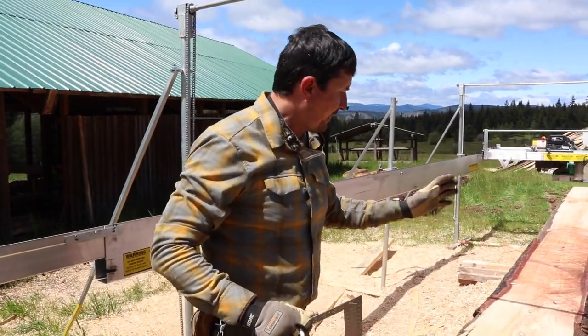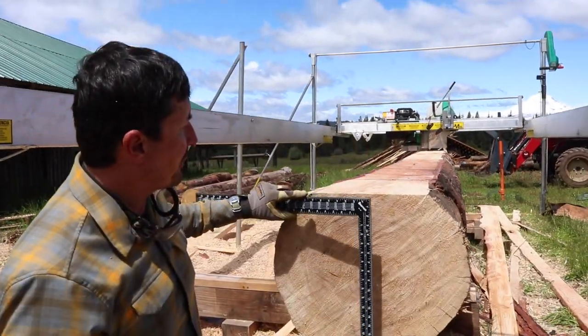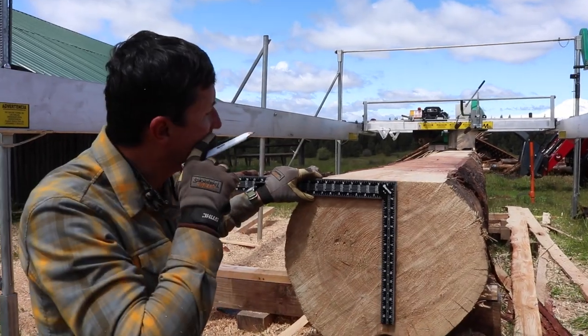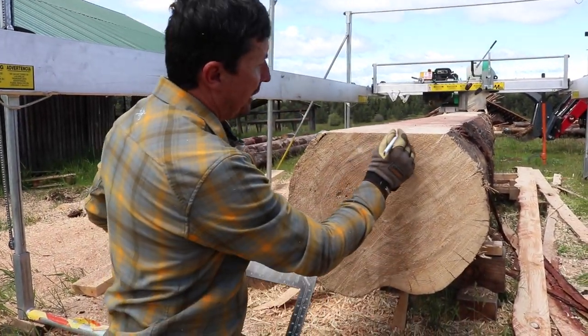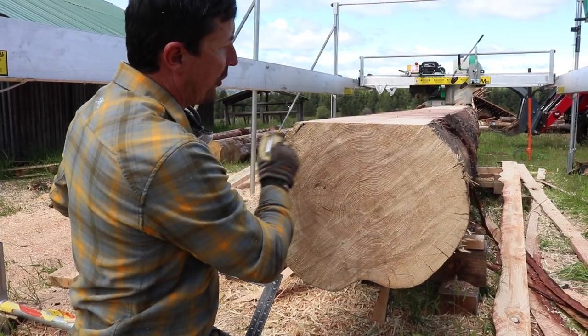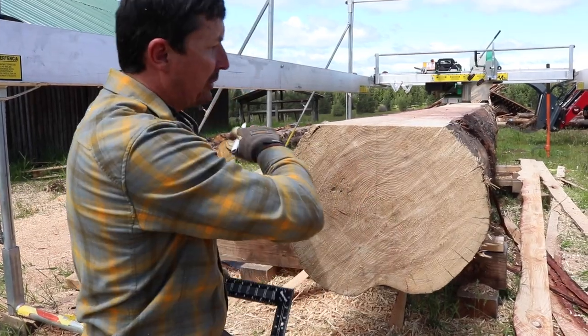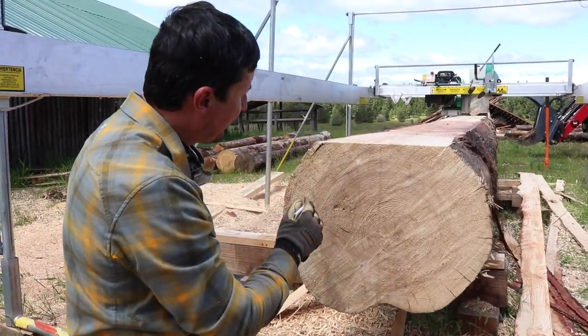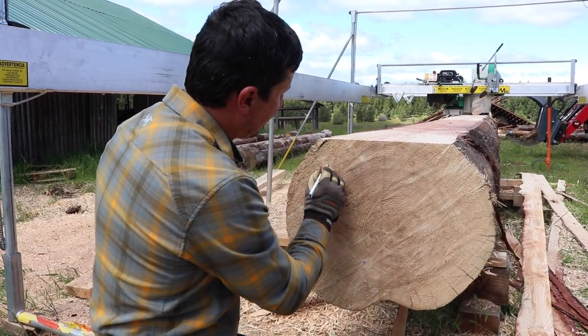Okay, so Brian and I flat topped this here, and we talked about what we're going to do. We have to cut a 6x10, so we have two choices. Either this is roughly the center line, and we cut it like this, or we cut them this way. It seemed to us that it would make more sense to lay them, so we'll cut them this way. We'll cut 6 inches deep, we can get a 6x10 here, so it's going to be 6 this way and 10 this way.